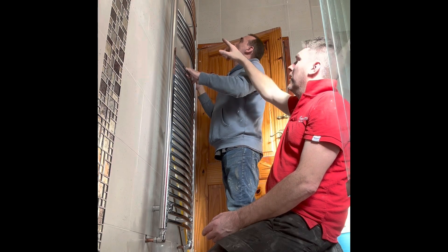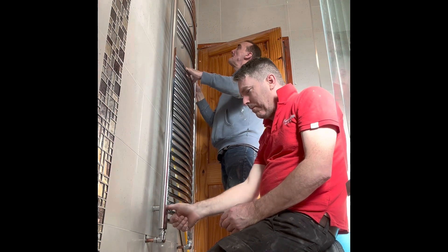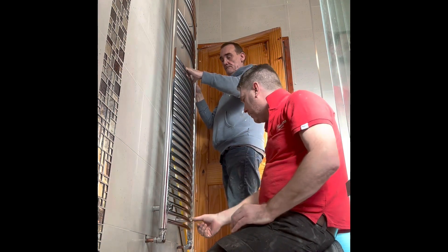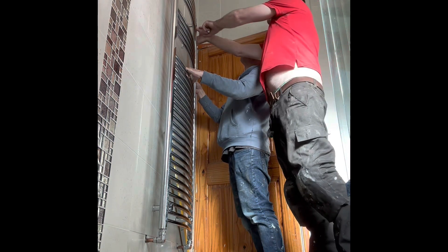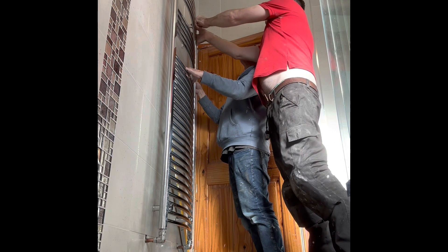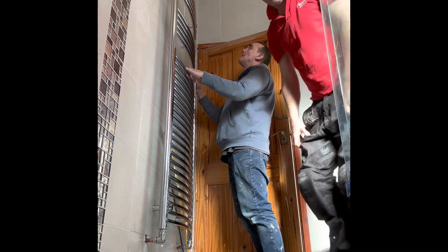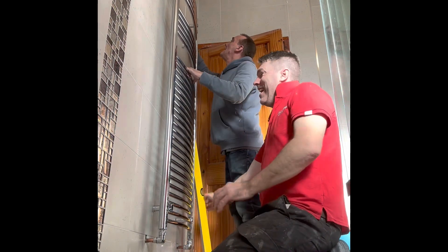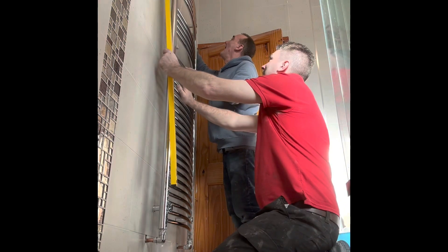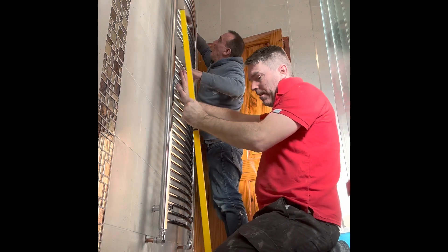Don't let your sidekick do it. What you want is an equal gap up — put your thumb there, that wants to be touching there, that wants to be touching there. See this top one here, that is not touching — that's two thumbs away, I can get two fingers in there. So you need to move that over before you mark it, and you need to move that over before you mark it — it's about 10 mil out of line.